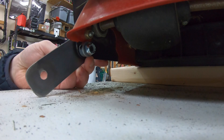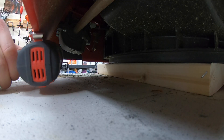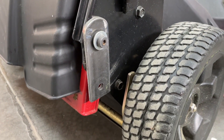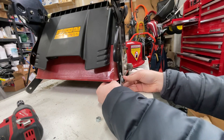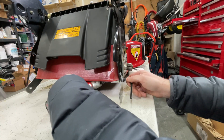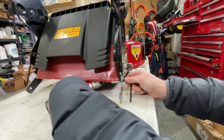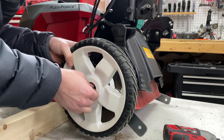Since the mounting point on this mower is close to the ground, make sure the lock nut is tight enough to hold the quick connect bracket off the ground. Those of you that have a bigger mower like the Toro Time Master don't have to worry as much about this, as it has a high enough mounting point that the brackets can just hang freely when not in use. But with this particular mower, make sure the lock nuts are as tight as can be to keep these brackets off the ground.